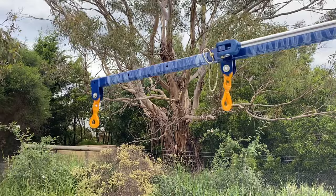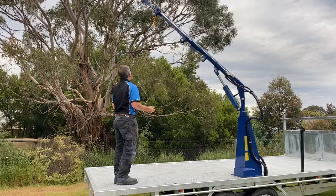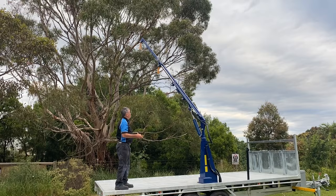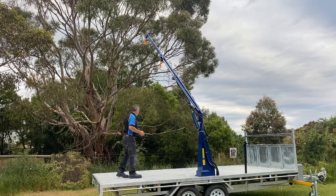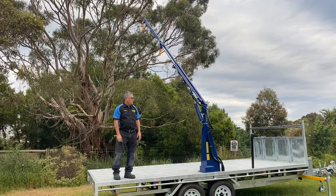To give you an idea of how high it goes, let's go up. You've got a long way under there — I'm not underneath it, I'm to the left of it. Easy to use as long as you go nice and slow, and you can drop things over the other side. Remember, there are four drop-down legs — set them up always. You might say 'I'm only going to pick up 100 kilos' — with this sort of trailer, if it's only 100 kilos you'd be fine with just the front unit. But if you're going to pick up 400 or 500 kilos, set it up properly. It's a good habit to get into and it works really well. So basically, that's it — that's as much as we'll put in this video for you.